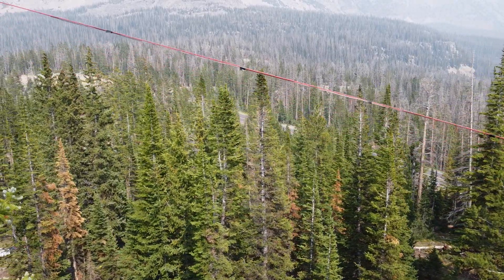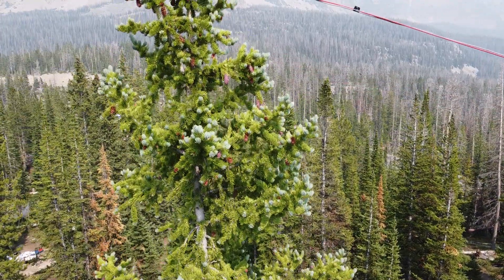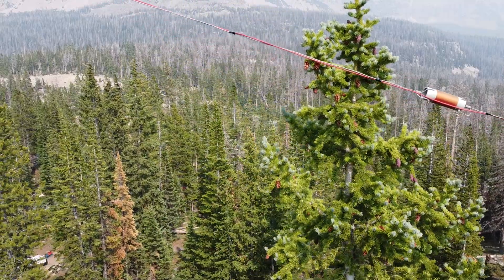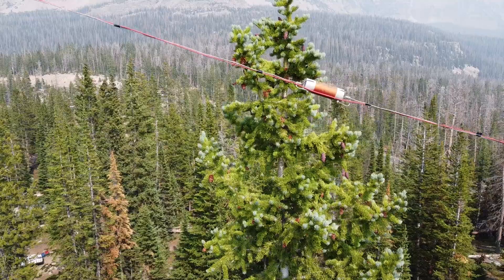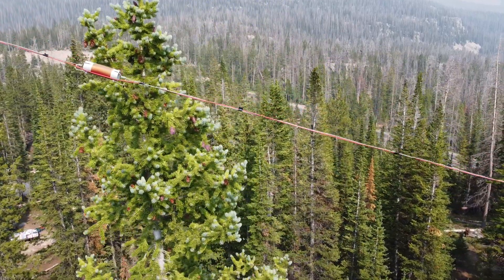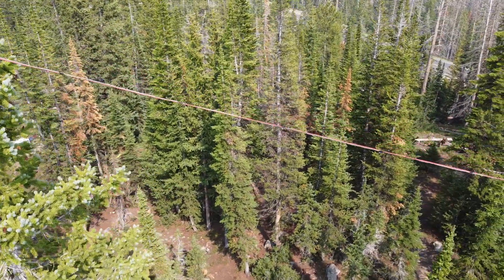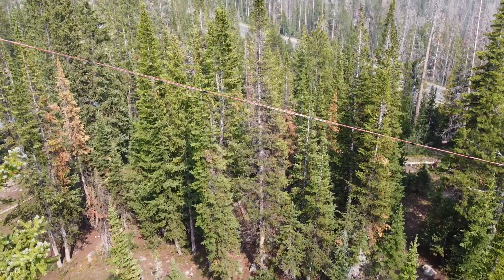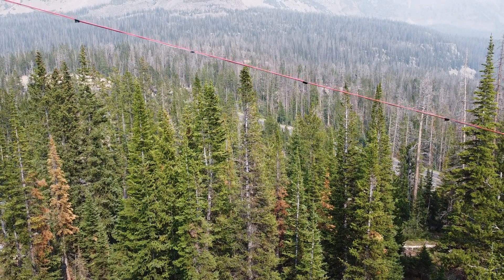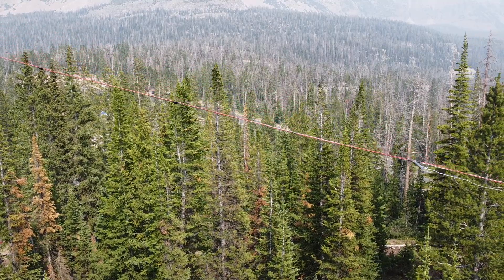He's going to come to the end here and you'll see the little trap — a typical Alpha-Delta trap, there it is right there — coming up to the other tree, and you can see a little bit of the mountains in the distance. I'm using LMR240 coax, which has a solid center conductor, which I like — it's lighter. I have a Mix 31 ferrite choke I just made up, effectively a 1:1 balun, which is hooked on at the feed point with the Alpha-Delta.